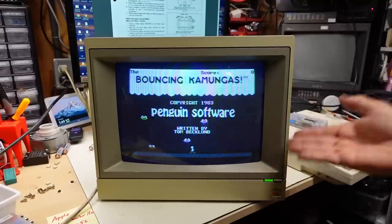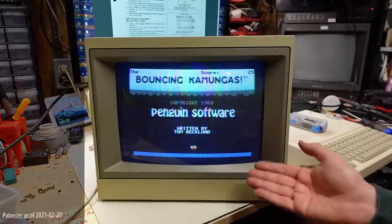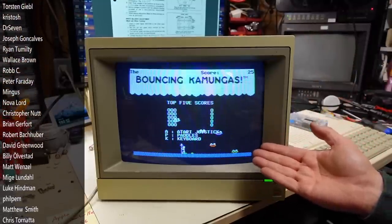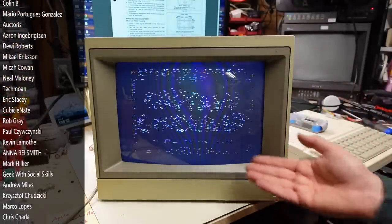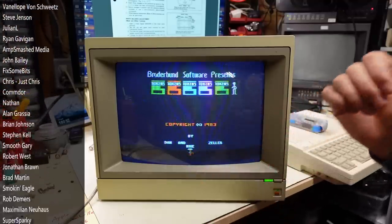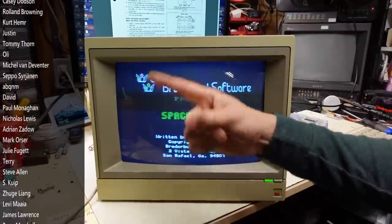I set out to fix this thing, I figured out what was wrong - it was that bad transistor. We found the right part and there it is, it's working and producing an image. I'd give it a C minus when it comes to picture quality - it's relatively displeasing, but this image is probably fine to someone who just wants to recreate their Apple IIe setup. It's usable, absolutely usable - it's just far, far away from what it looked like when new. Hopefully you learned something - even without schematics, with a little bit of logical thinking you can trace your way through the circuit and figure out where the issue is. When it comes to composite color monitors like this and the 1702, there's just not a lot of difference from one monitor to another in how they work, so you can use the process of elimination to figure out what's working and what's not. Thanks to my patrons - comment down below with your thoughts and questions. Stay healthy, stay safe, and I'll see you next time.